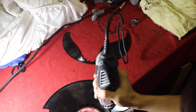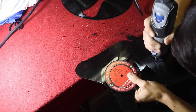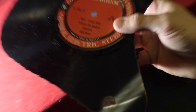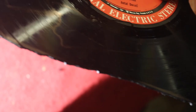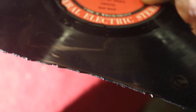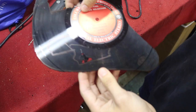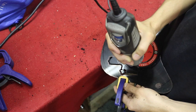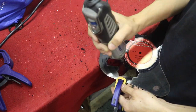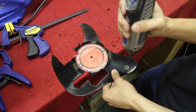Make sure to go along the lines nice and smoothly — I went a lot slower than shown here. Once you have the rough cut done, don't forget the inside pickup cutouts. Be very careful around those small edges because they will break on you. Once done, clamp it down, then route out the inside pickup holes and the small hole for the knob.